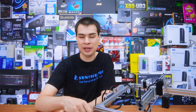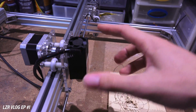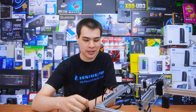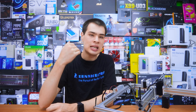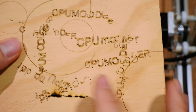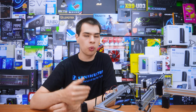Once assembled, I finally got this thing fired up and started burning some lasers. You may have noticed from the laser engraver vlog series linked below — yes, I did get it to actually burn stuff, but another problem arose. Even though I got the software talking with the hardware, I've now run into a drifting problem where the Y axis doesn't really increment. Looking at these test burns, when I tried to engrave the word 'CP Modder' on a piece of wood, the first few letters line up and then the rest shifts around.